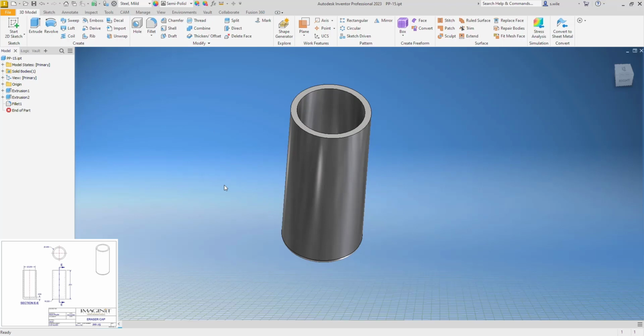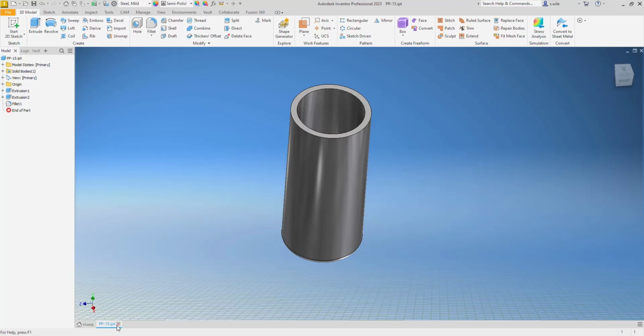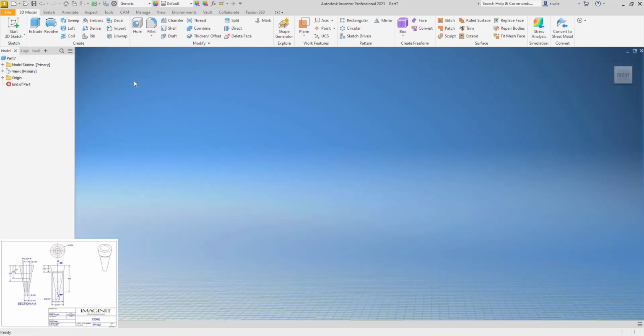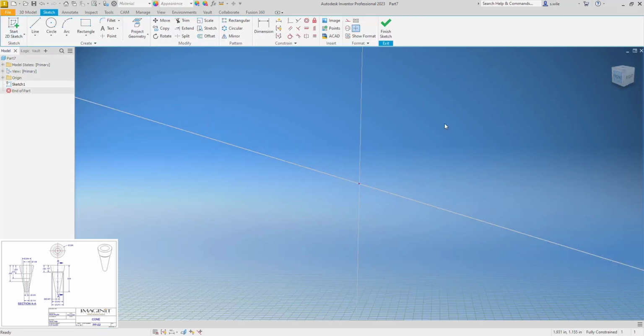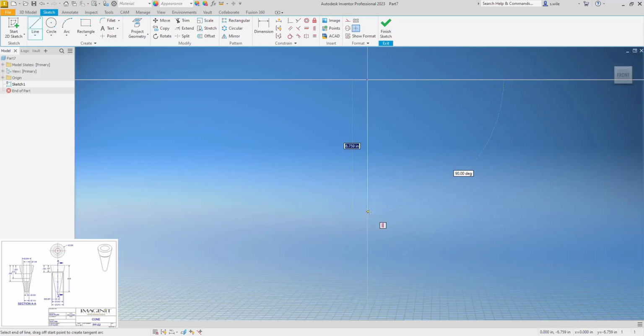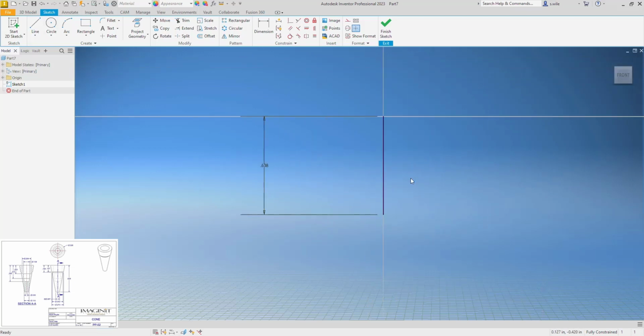All right, now I think we'll go back to the beginning and just work through these, what's left from start to finish. We kind of did the easy ones. We'll just start at PP02. So I think I'll start this with a revolve and get the outside shape. So we'll put a sketch on a plane, and the overall length is 0.638. That kind of sets my scale so I can zoom in on the sketch.